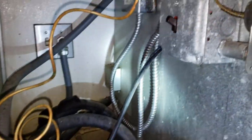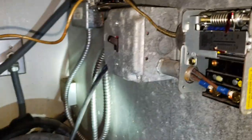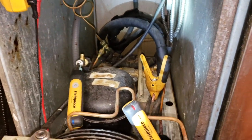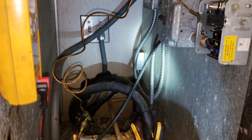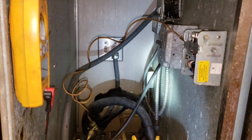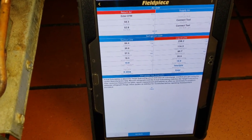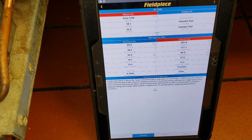I've started the system up. I started with my cut-in pressure which is going to be in the 80s - I took my pressure chart and found 39 degrees, which is the temperature I want this system to turn back on at. So I set my cut-in on the pressure control at 39 and will adjust the differential or cutout as I watch the box run. The box is running right now at 58 degrees and we're watching everything operate.